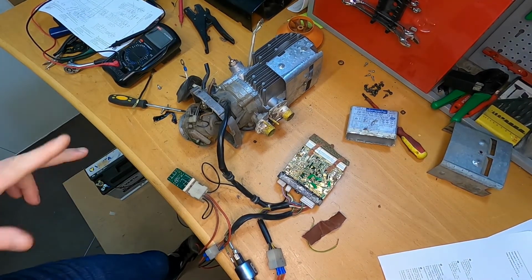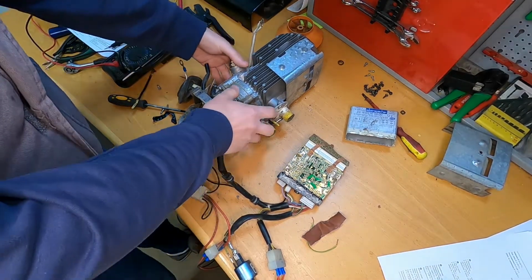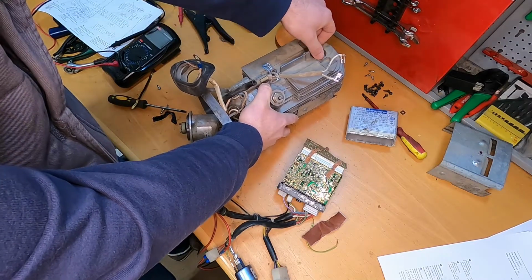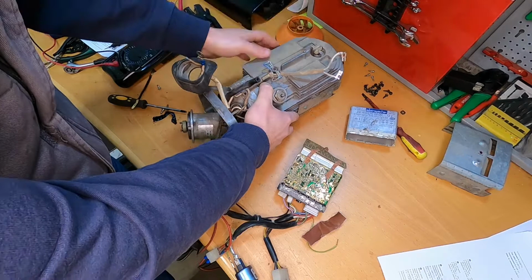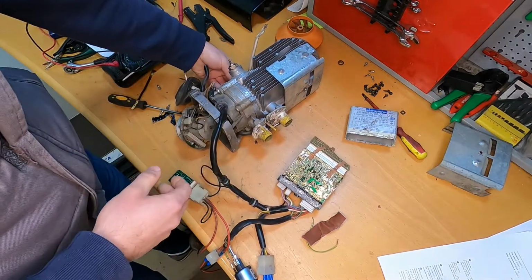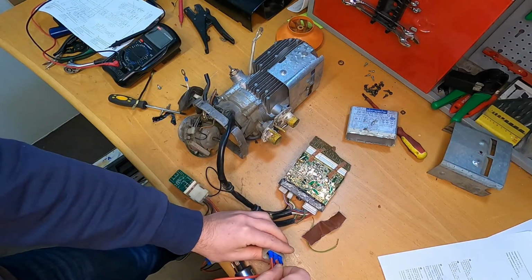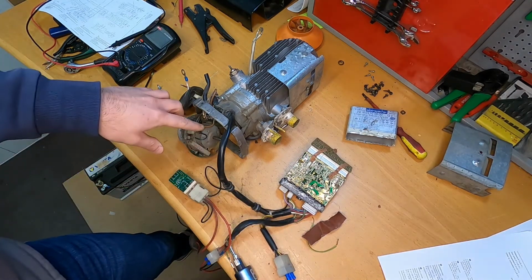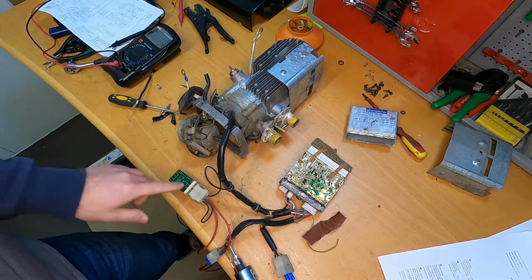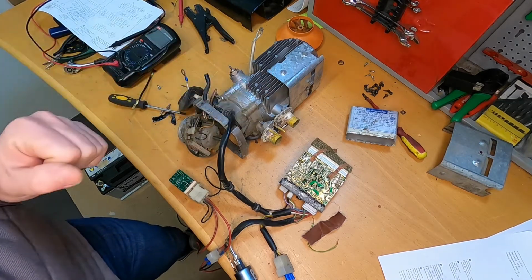So actually I think I got this figured out now after a few more tests. The temperature sensor on the top is actually the one that detects flame by measuring the temperature of the heat exchanger. When we start the unit, if this sensor is open, the unit will start to ventilate. So it will just start the fan in order to cool down the heat exchanger, and it will not start the glow plug and the pump until the heat exchanger is at the cool down temperature.